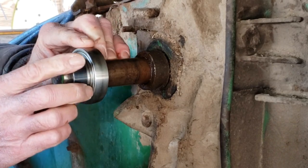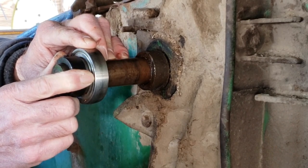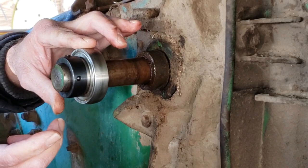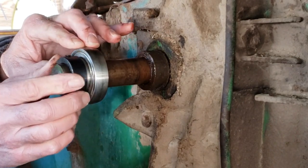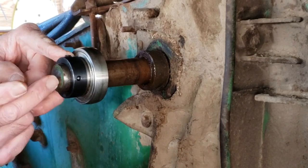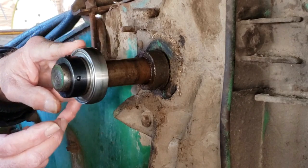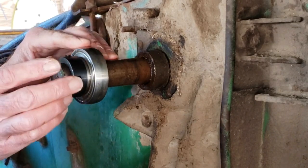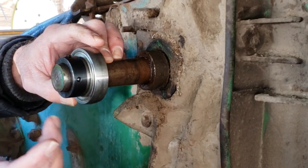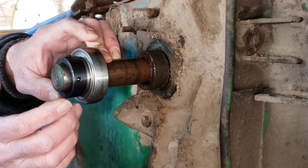I still don't have resistance yet, so I'm going to rotate the whole thing around this way — and right there is where it got hand tight. I can see that I've grabbed the inside race. And because this is slightly off-center eccentric, it has bound the race against the shaft — just slightly. If it was really off center, you'd bind the bearing up so bad it wouldn't work right. But that's how that collar works. I just got it hand tight, so you take a punch — there's the punch hole — and tap it on around this way to really lock it in. Then take an Allen wrench and set that screw. Don't rely on that screw; get this thing truly locked.